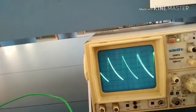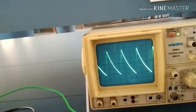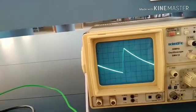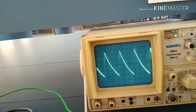You can see that now it is set to 0.1 µF. If you change the capacitance value, the width of the sawtooth waveform will vary accordingly.